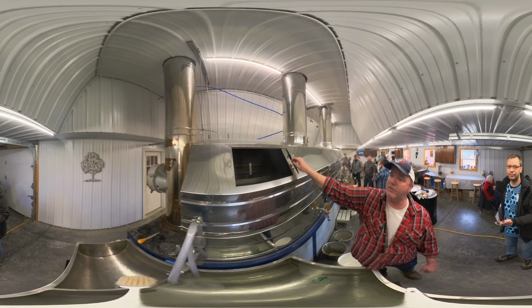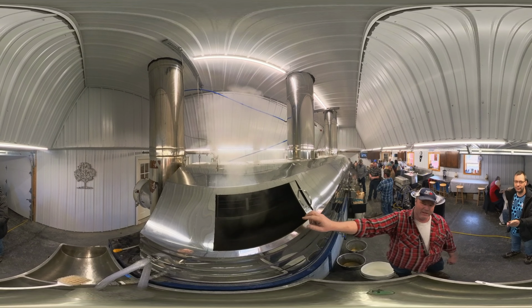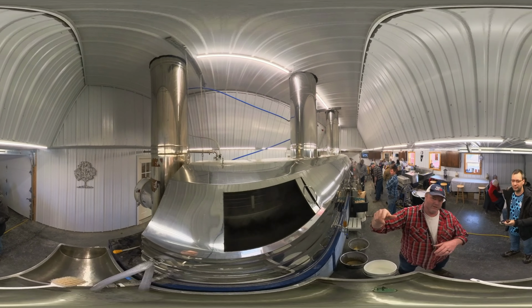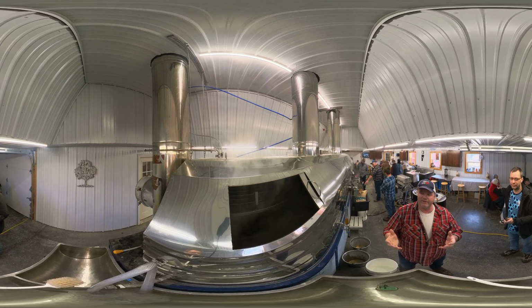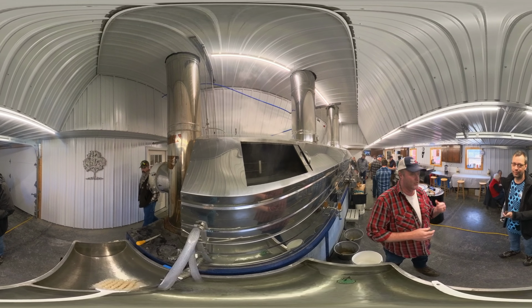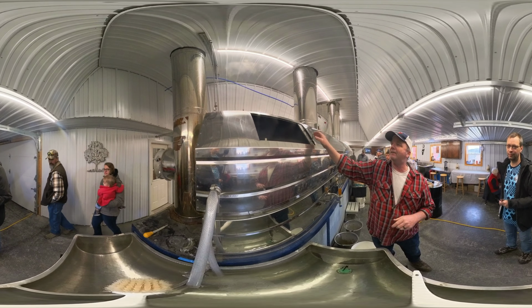Before it drops in, there's a preheater on here that preheats the concentrate through these copper pipes, with the steam going around them back and forth. The steam around that preheats it up to about 200 degrees. A byproduct of that is the steam collecting around that cold concentrate will create condensation, which drips onto a bottom pan and runs out into this tank. So it gives us some nice clear wash water that we use for washing up, washing the filter press. Even we'll dip our hands in there to wash them, but it is very hot.